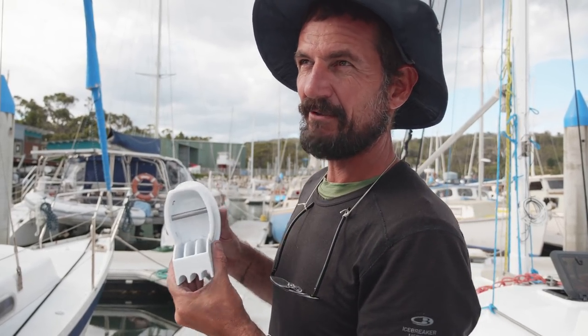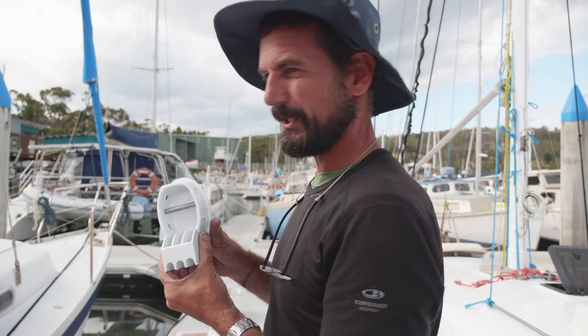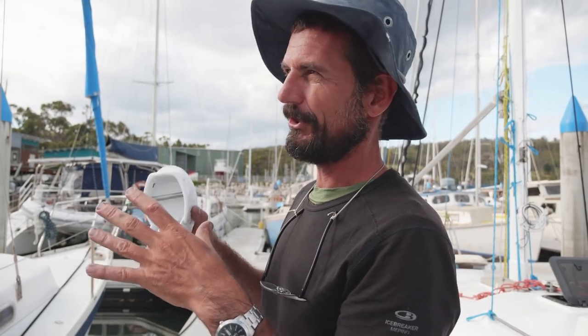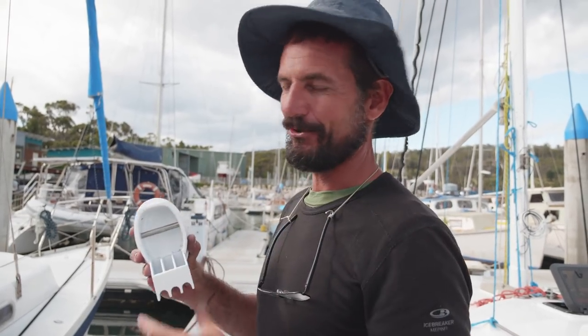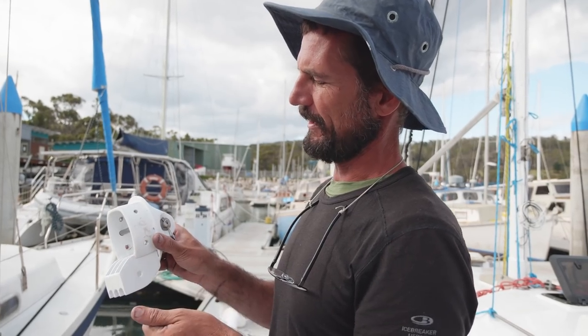The reason I did that, rather than just leaving it as a pin that could slide back and forward, talking to Pete the rigger, he's just advised that if you're ever at sea and you want to pull it off, sure as eggs, as soon as you pull that out in the seaway, you'll drop that pin straight overboard. So we'll just fix it in, use a bit of that sealant and that'll hold it in.